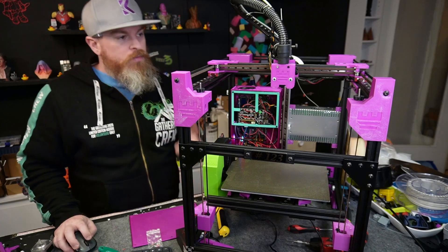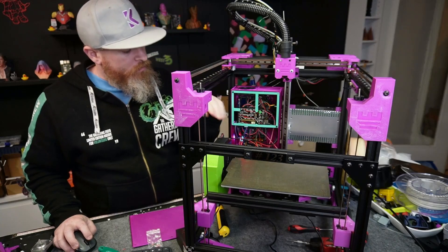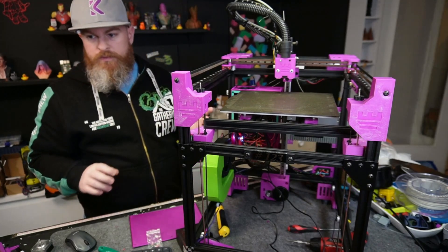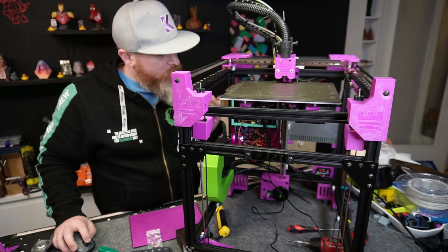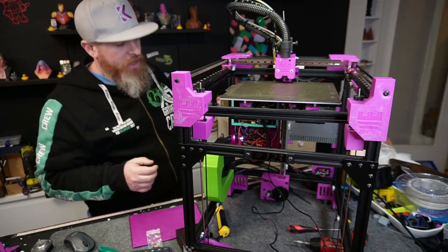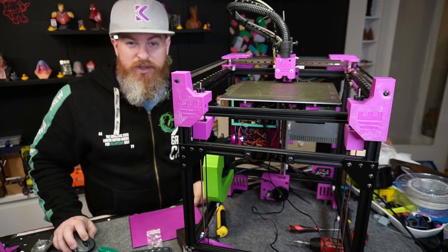Homing X — good. Homing Y — yes. Homing Z — works too. I need to tuck some wires out of the way, but I need Z up to do that. It looks like the printer is working now. I'll spend about an hour stress testing to see if the error comes back. If it does, I'd have to add two boards on top of the Skipper, making three boards total — really don't want that.